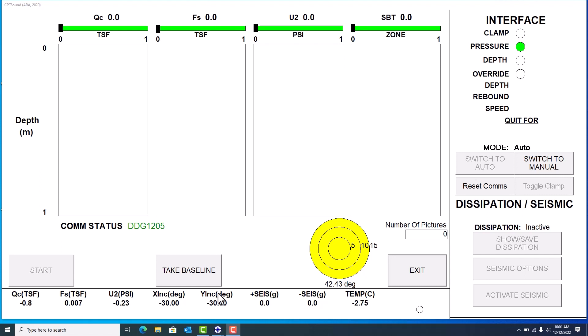I have CPT Sound opened up and I'm ready to take a test with all my equipment plugged in. The first thing to know is that the way you have your equipment set up is very crucial to how successful you're going to be. A few tips: mark the geophone on your cone to make sure your geophones are pointed towards your strike plate — we have a pro tip video on that — and make sure you have plenty of weight on either your seismic beam or your strike plate.